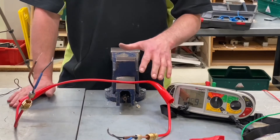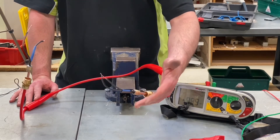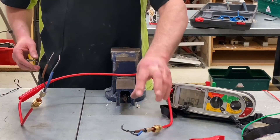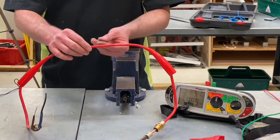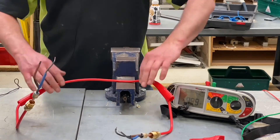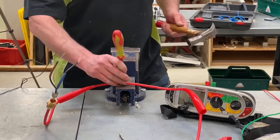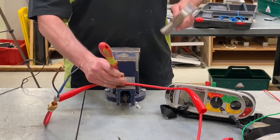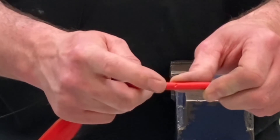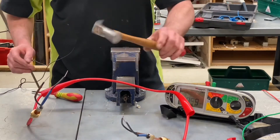So not only is the cable fire resistive, we know the ends aren't — they tend to be attached to plastic emergency light fittings, plastic-backed bells for alarm systems, and break glasses. So we know the cable itself is fire resistive and the pots we put on aren't. But we also now know it's a highly robust cable if you hit it with a blunt object. Let's now hit it with a non-blunt object in a different undamaged area — using a screwdriver and hammer, you can see it goes straight through. So sharp objects won't be as strong mechanically, but you can certainly give it a good whack with a blunt object.